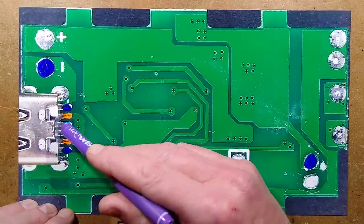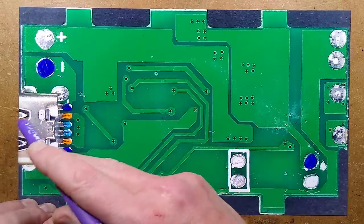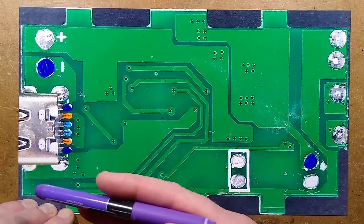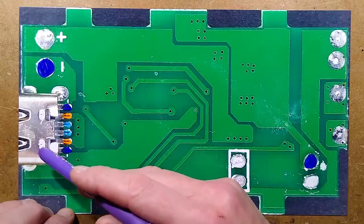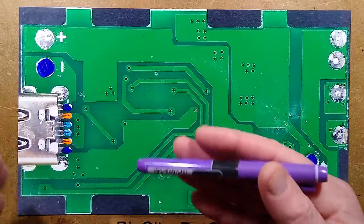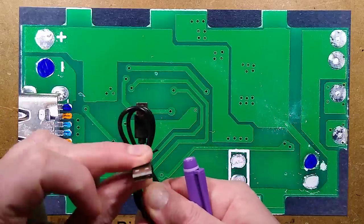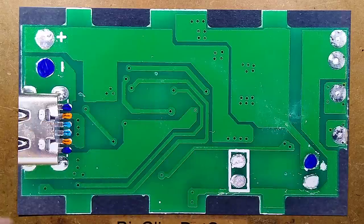There are no resistors to tell an intelligent device outputting USB to USB-C to actually put out current. So if you have a problem charging this unit from intelligent modern chargers, you may want to just use the lead that's supplied with it and plug it into a straightforward, dumb USB power bank or power supply.